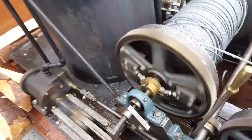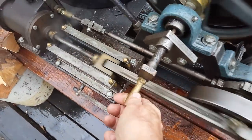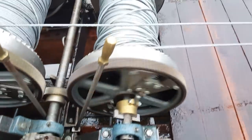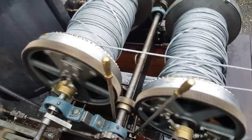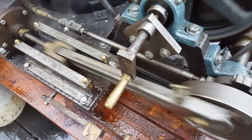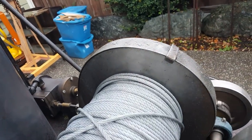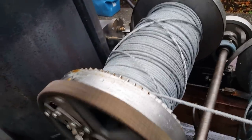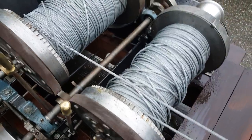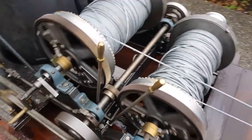The clutches are right here. Crank this in — you'll notice that one starts moving. I don't have the cable out. This is the haul-in or haul-out. Brake bands are here; the brake-clutch mechanism is right here. You can see that one moving. There are a lot of grease points on it that are important. There's 500 feet of cable on each one — one to haul in and one to haul out the hook.